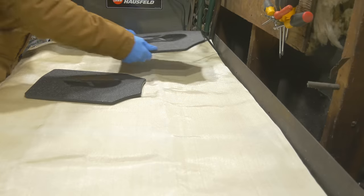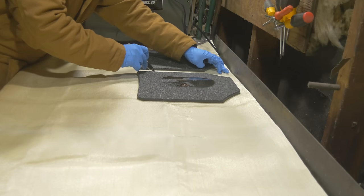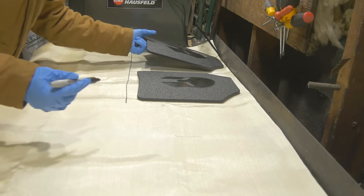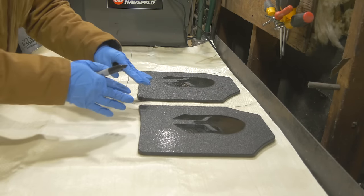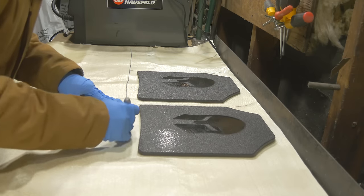Anyways, so I'm gonna open this up. Wow, this is a lot. So I got the fiberglass laid out. I'm just going to do some rough markings for some rough cuts. I can tell just from the way this thing is woven, it is not gonna behave very well once I cut it apart. It's gonna start fraying and stuff. So we're gonna cut with about an inch on both sides, and once we have all the resin cured and everything, then we're just gonna cut the edges off.